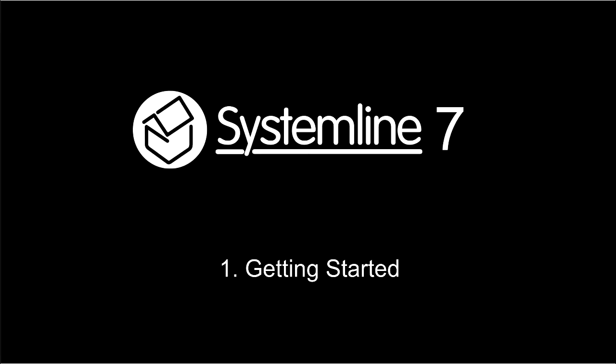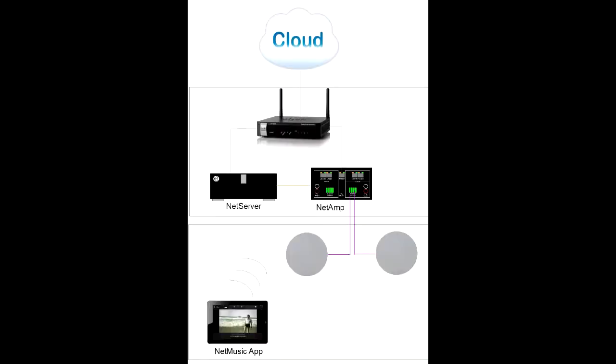This video will cover the basic connectivity and configuration to get the core System Line 7 system up and running. For this video, we've connected a System Line 7 net server to the internet via the router. It has a digital output connected to a NetAmp, which is connected to a pair of speakers in the zone using speaker cable, and operation in the core system is using the NetMusic app on an iOS 7 iPad.